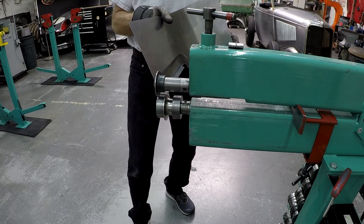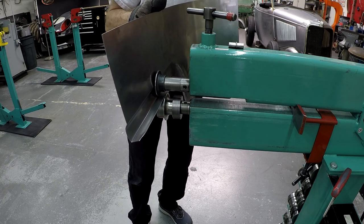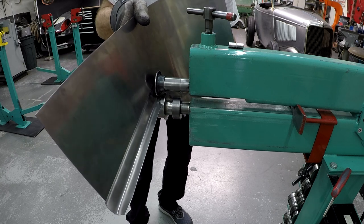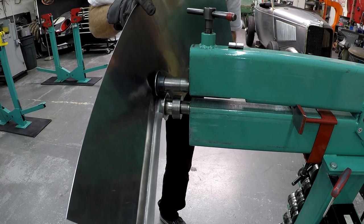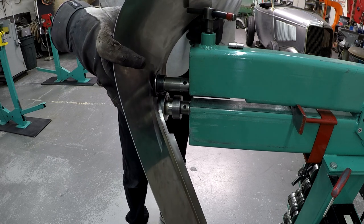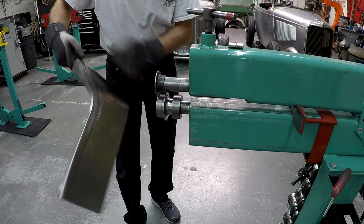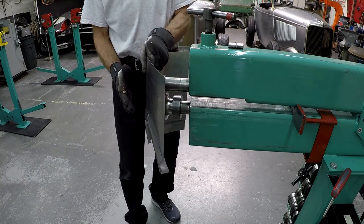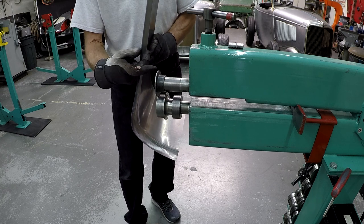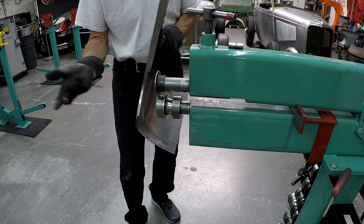So I guess this is going to be the last one. So now I'm up all the way with the die, or the metal up to the die. The flange there is so narrow in the inner curve. So we will see if I can get that to work without stretching it. So here you can see now, if you see it from the camera there, that this is pretty much straight. And it is because this flange is more narrow than here. If this flange had been the same width all the way here, then I must stretch this, but it's so narrow now, so it works anyway.